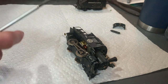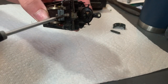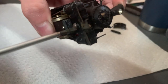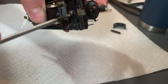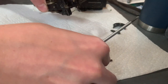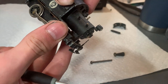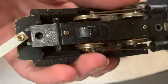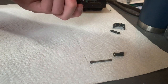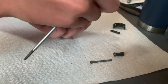Let's start disassembling the engine. It looks like this big screw right here is how this whole thing comes apart, so let's just take that big screw out. I've not taken this thing apart before. It looks like the stack is actually threaded. Let's get this screw out and that should release our body. There's our stack — let's just gently lift this thing up. Something is still holding it in. I see — right there, there's a little screw down in that hole. Let's get that screw out. We've got to be careful because this thing is made out of zinc and brass — it's very fragile.